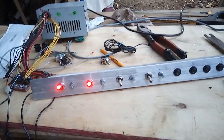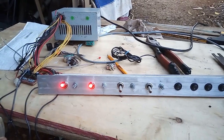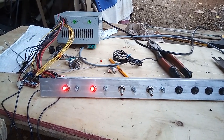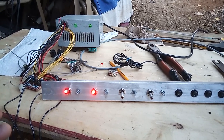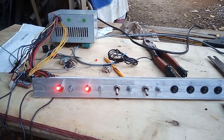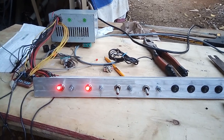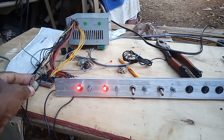That is the reason why most sound owners, when they are playing their sound, hear this squeaking from an amplifier and wonder what the problem is. They also uninstall the amplifier out of the rack and bring it to the technician to work on. But trust me, most of the time it is the wire that goes to the remote. It is too small, so enough amperage is not going.